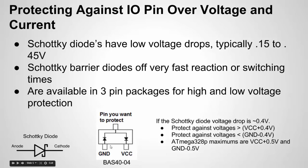The Schottky diode is a great protection method, especially in the three-pin version. I recently had a design where I was reading a trigger from an external device I couldn't fully control, and the Schottky diode protected me from unexpected voltages. For a low-risk situation you can use a Zener, but you can always use a Schottky. Note that if there's too much voltage and the Schottky conducts to VCC, that will push VCC higher — unless you have a Zener diode on the supply to shunt it. So both protection methods work together.